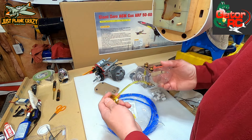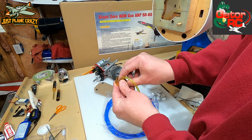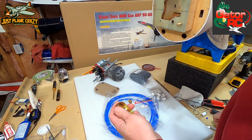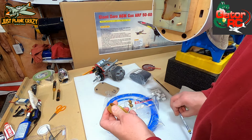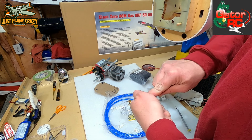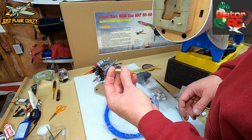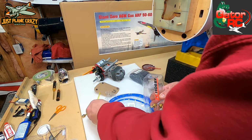So the first thing we're going to do is open up this tank, and you are going to see that there is an O-ring seal in there. Sometimes those things aren't exactly in the groove, and we need them to be exactly in the groove, otherwise they come out. I don't use these yellow lines because this tygon tubing, if we can get that off of there, tygon tubing tends to get hard and brittle over time. And you may get a season or two and the stuff will get hard. And that's a problem when you start rolling into different positions or you start running past that level of fuel. So what I like to do is take this tygon tubing out. I've tried different fuels and stuff before, and also that's just a straight unfiltered clunk and it works well. I don't use it. You have a bunch of extra seals and pieces in here. We're going to take those out, and as well a clamp.